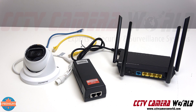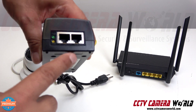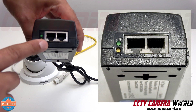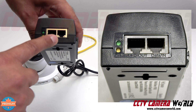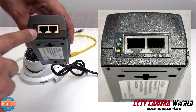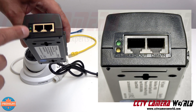Make sure you've got a good fast internet connection. When physically setting up the camera, you need a PoE injector — note there are two different kinds of connections. On the left-hand side it says P plus D, which is power plus data, and on the right-hand side it says data in. That's where you connect a network connection going back to your router. The P plus D side goes to the camera and sends PoE power — power and data — using PoE technology.